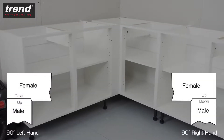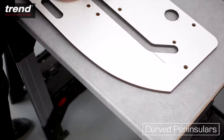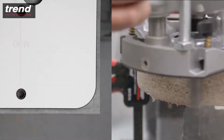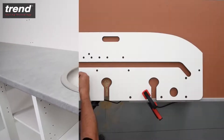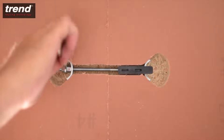It's suitable for routing left-hand and right-hand corner joints at 90 or 45 degrees, as well as curved peninsulas, 40 and 100mm radius cuts, end cuts, kitchen door holes, and 3/4 inch BSP holes for mixer taps. The jig also enables you to route perfectly aligned recesses for dog bone style connectors, which pull the joints together.